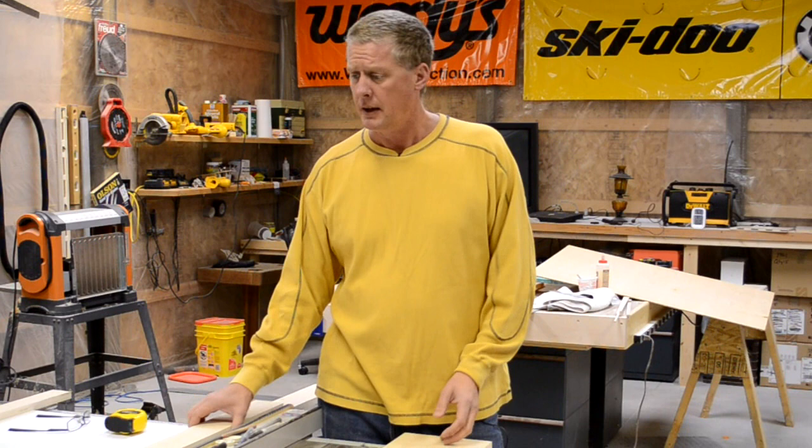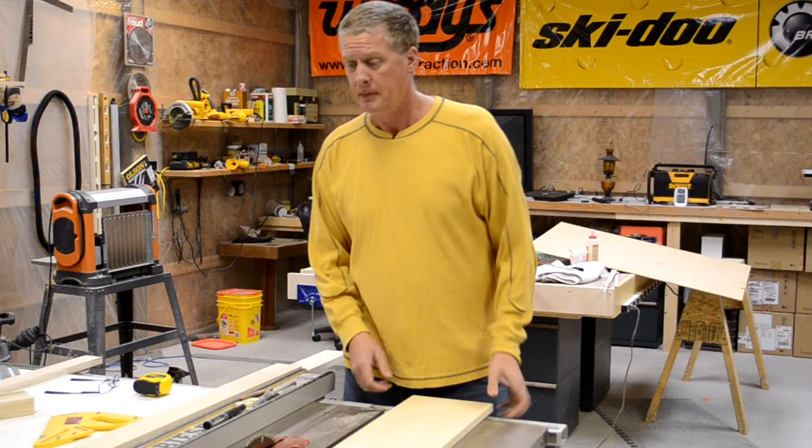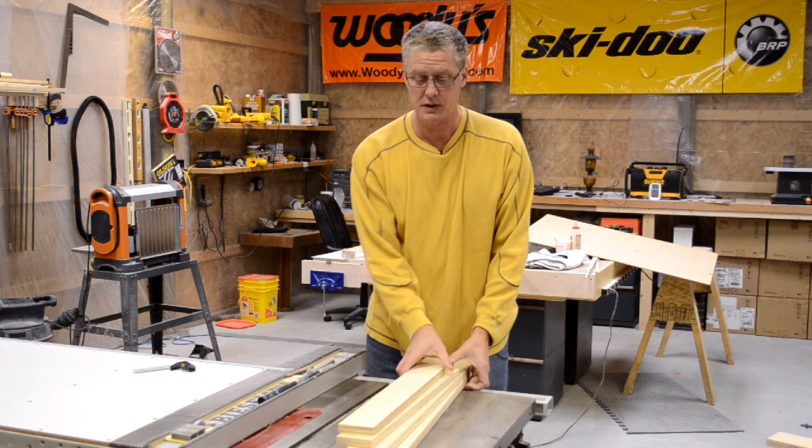And I'm going to make it 42 inches wide. I chose that width simply because that's about the width of the scrap piece of quarter inch plywood I have lying around the shop. And so right now I'm just ripping down my plywood to 3 inches. All right, I got my drawer stock all cut to size, and I'm going to now cut a dado in all four pieces.